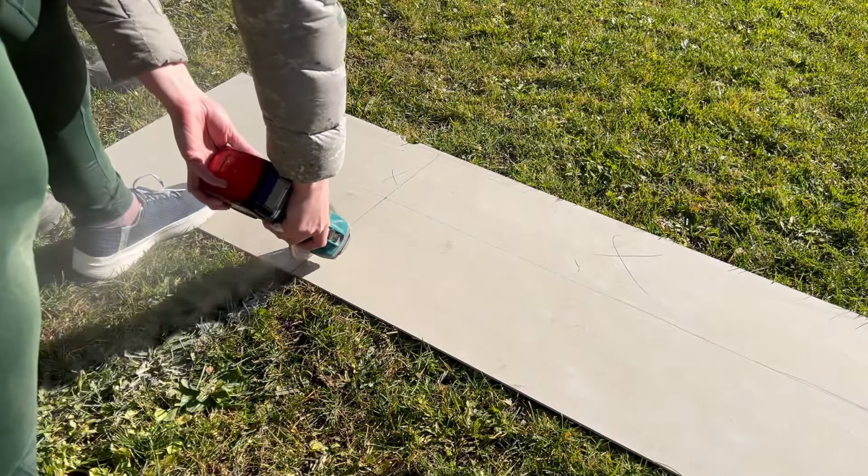The wall tiling is now finally finished in this bathroom. It was definitely a mammoth effort — we have tiled all the way to the ceiling and the entire way around the bathroom, and there were a few tricky cuts but we have now finished. Next I needed to remove all of the tile spacers — I went along with my hammer and popped out the red tile spaces on the joins, and then removed all of the little cross spacers as well. I'm then going to come in with a scraper and scrape out any glue I can see in between each of the tiles so that I can apply the grout and it will go really nicely and evenly throughout each of these tile spaces.